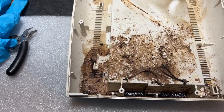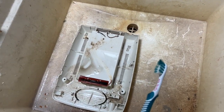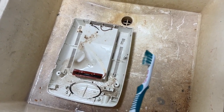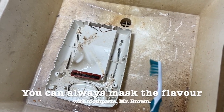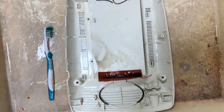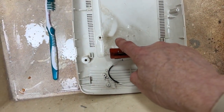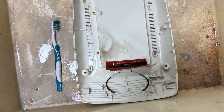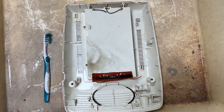I'm going to wash it and see what happens — with gloves, of course. I also had to cut the two wires to the battery compartment. Most of that brown stuff seems to be water soluble, so I think it must be battery leakage. I'm going to use my brother's toothbrush and remove the rest — it may change the flavor of the toothbrush, but I don't think you'll notice. I'll also try some vinegar to remove the remaining stuff. This other residue is not battery corrosion — it looks like it's from the picture tube, so it's carbon, which can come off with alcohol.